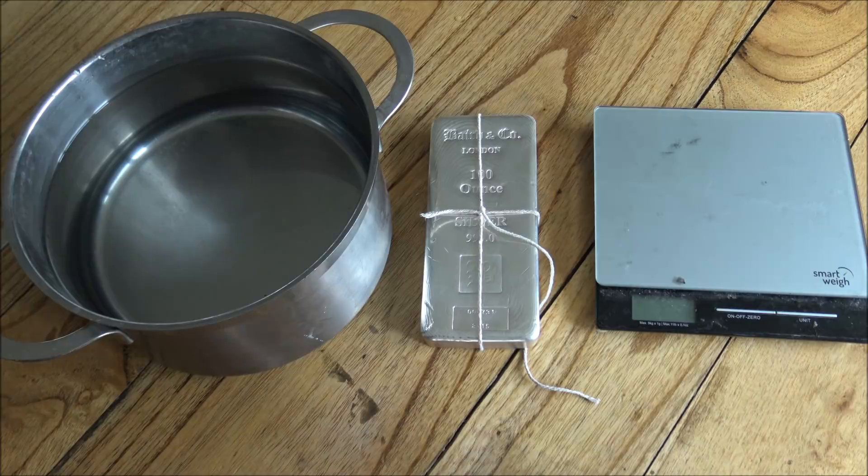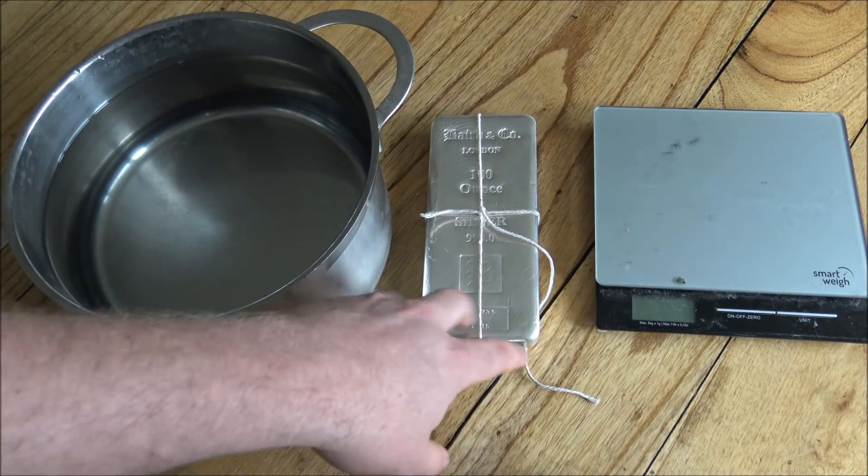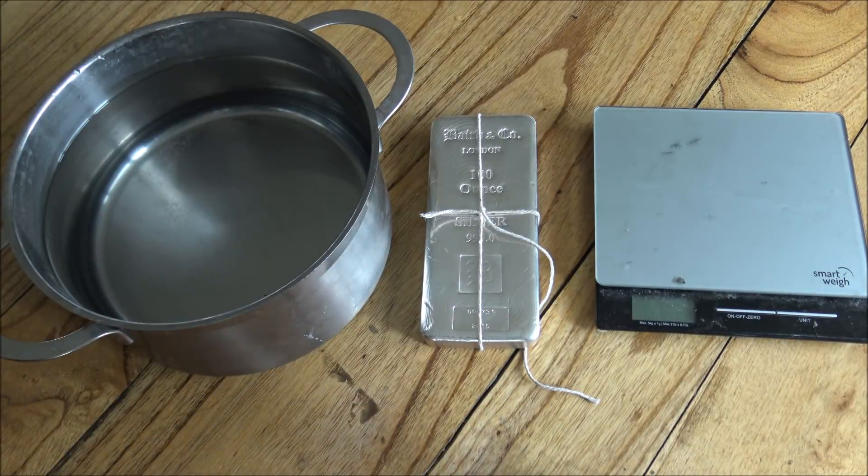Specific gravity will vary from a number of different factors, but you can be pretty much certain that if something comes out between 10.4 and 10.5, it is going to be pure 999 silver. Sterling silver has a specific gravity lower than that — about 10.3. There are different alloys of silver and gold with different specific gravities you can work out and test. It is a somewhat limited test in the sense that it measures volume — the displacement of water. So if you've got a piece with a hollow center, or air pockets where water might not get in, you won't get a true result.